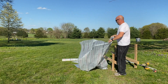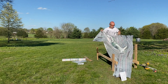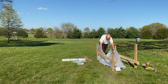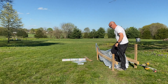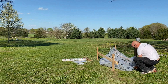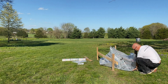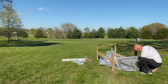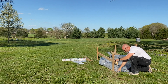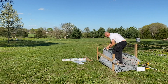The Fast Foot fabric comes with printed lines — it has a center line that you lay right in the center of the wall. Sometimes we'll stick a couple nails through the center line to hold it. It also has lines for 16-inch, 20, 24, 28, 32, all the way up to about 44-inch wide footings. For a 24-inch wide footer, your center line is here and your 24-inch line is here. You hold that down, bring it up over, take your staple gun and staple it there, then do the same on the other side.